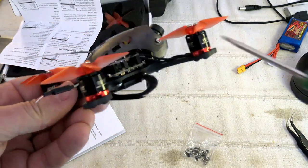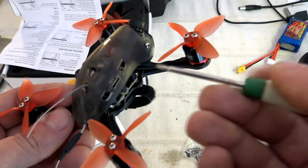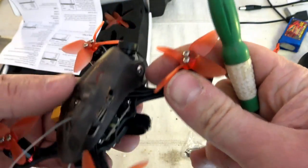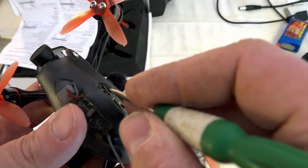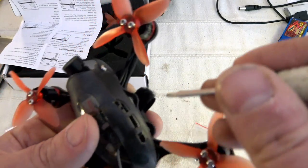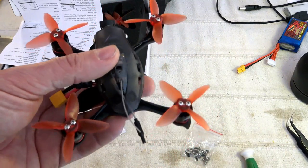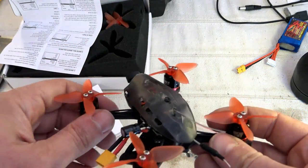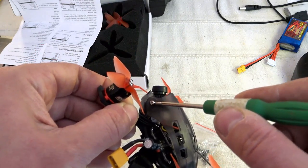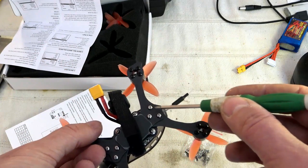If you want to select it, you will need to check the right port. There is a small button here, and this is where you can click from the external point of view. You absolutely need a relatively thin pin to select it, because it's not so obvious, and we will see that the consequence is that most of the time when you need to make a selection, you will probably need to remove the top canopy. How to proceed? You will need to remove these small M2 screws, one here and the second here, and the third and the fourth here.